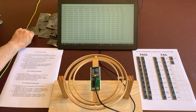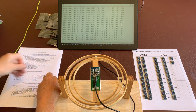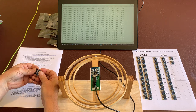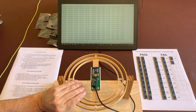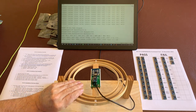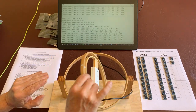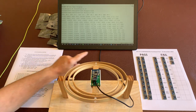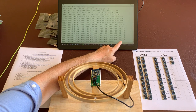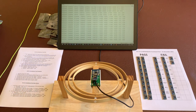We always investigate the failures to see what they might indicate. Putting it on the header again — this will be number three. They're quite quick to test. Well, that one's not a pass, and we can see a problem here as well — a very small range. This sensor is completely unusable. It doesn't have enough range to respond to the magnetic Z axis. I've written that down. We'll try the next one.